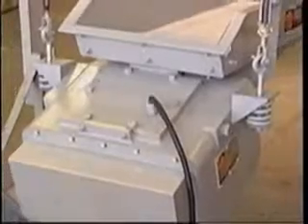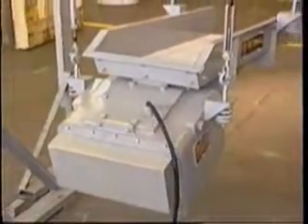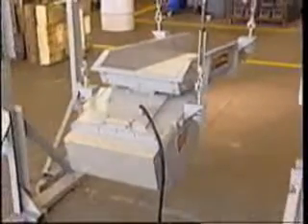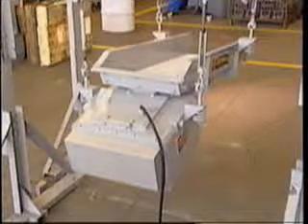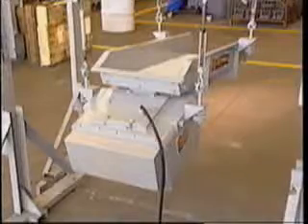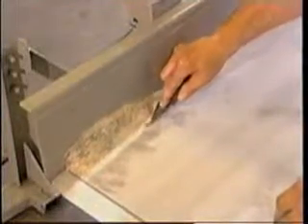Never operate the unit if you hear a striking noise. If you hear this sound, immediately turn it off and proceed to setting the air gap before starting maintenance procedures. If the feeder behaves erratically or exhibits greatly reduced tray displacement, there are several things you should check. First, visually inspect the feeder for stray debris accumulations obstructing the tray or feeder housing.